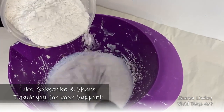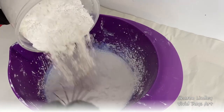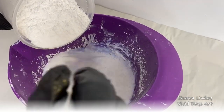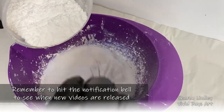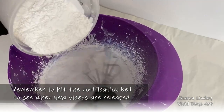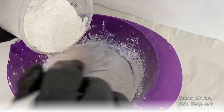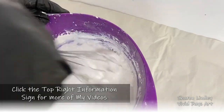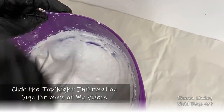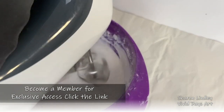Now remember, Jesmonite is a 2.5 to 1 ratio, the powder versus the fluid. 2.5 is the powder and the 1 is the fluid. Now when you add your pigments, it is very sensitive, so you need to keep the balance fairly right. Anyway, let your imagination go, and when we're mixing our fluid, remember to add your powder to your fluid, and you want that smooth batter-like consistency. We don't want any lumps in our plaques or Jesmonite, but even though I talk about pancake mix, it is not food, please do not eat it.